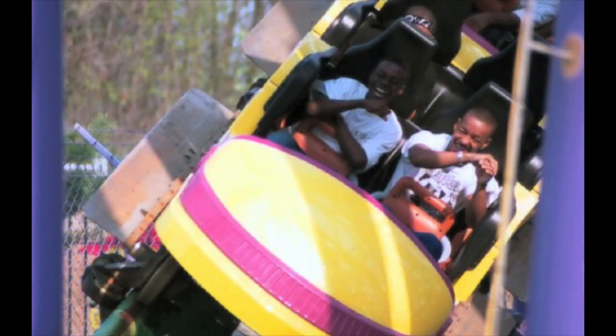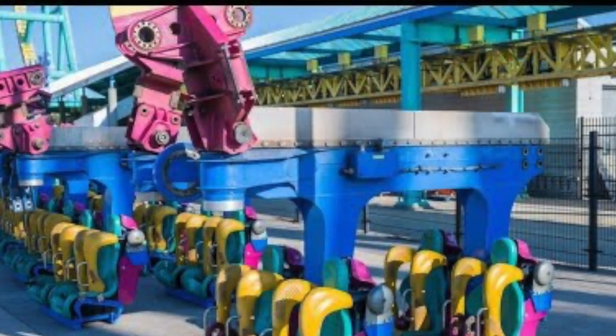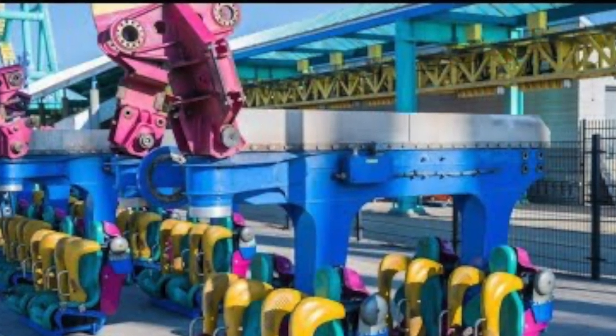Or, I believe Premier is the other one that uses the reactive fins, but they put them out to the side, one fin for each side. So you have three fins in the center, or one fin out to each side, and those are called reactive fins. They are what generate the driving force for the train, and they are made out of a very special compound that is not a well-known thing. It's kind of a trade secret, the exact metals that are inside of them, but predominantly they are copper, aluminum, and then a very little amount of nickel in there.